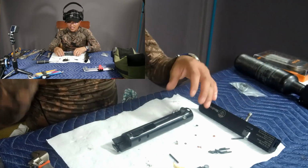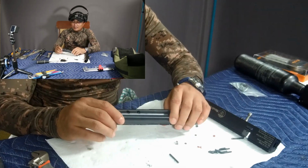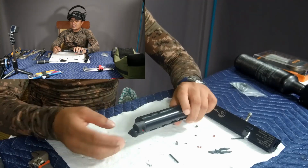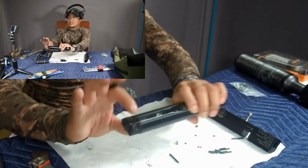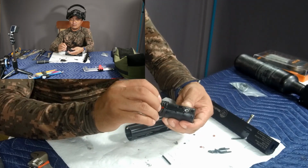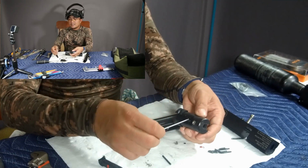Otherwise this would be some long video, but we'll take you through breaking down this trigger assembly and reassembling it. But after that, all you do, pay attention to the orientation of where this flat surface is as well. And when you pull it out, be careful. After you've gotten that pin loose, be careful to keep this together like this, okay? Because when you pull out this backstop, or what you call that, there is actually a little Delrin ball bearing that would sit right there, okay? And then there's also another spring right there.